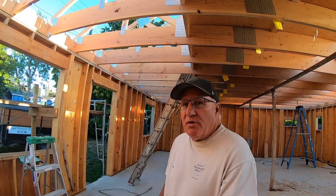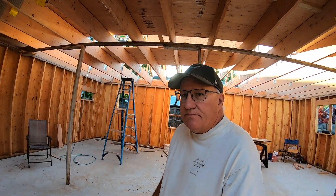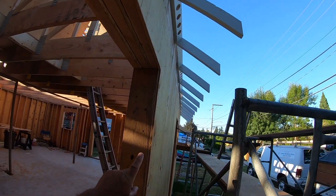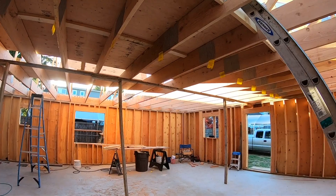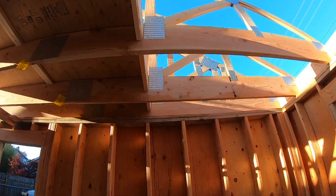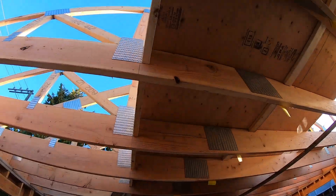Good morning. We are back on the project here, it is Wednesday morning. We're taking this whole week and pretty much working on the little house out here on the property. Out here on the eaves, you can see Charles has those all painted and all the bird blocks are painted. When we put our plywood down, we actually painted the bottom side of the plywood too. We are using all plywood here — I decided just to go ahead and build it the old fashioned way. We have all of our blocking in along this side, right along the edge of that plywood.